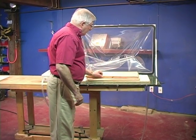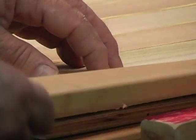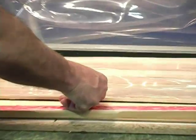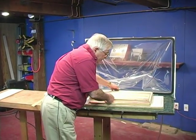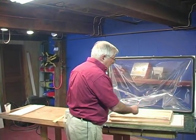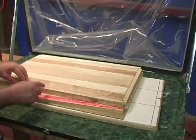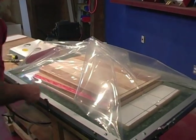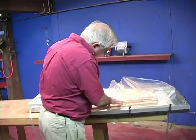As we go along, you'll see how this works. So now I'm just going to glue them up. We're ready now. We're going to put the second one on. I put a piece of plastic between them because I don't want to stick one to the other. The frame press is obviously better suited to this than a bag, because I could have laid my pieces — especially if you're doing a 4x8 or a big sheet — you just lay them up in place and close the lid when you're done. This is my side piece; it's going to give me more side pressure than just these thin pieces here.